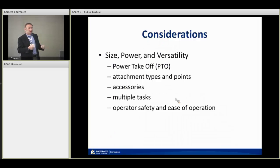Consider whether you have need for power takeoff — Mike had a picture of the ground-drive ATV pull spreader, and I've got some MSRP figures. Or do you need a power takeoff to drive other implements, like a slightly bigger box spreader? Also think about attachment types and hitches you might need for implements that fit your type of operation. And I think a big one — a lot of hobby farms and small-scale commercial operations have new farmers who may not have experience with power equipment, so operator safety is a big deal to consider in equipment selection.